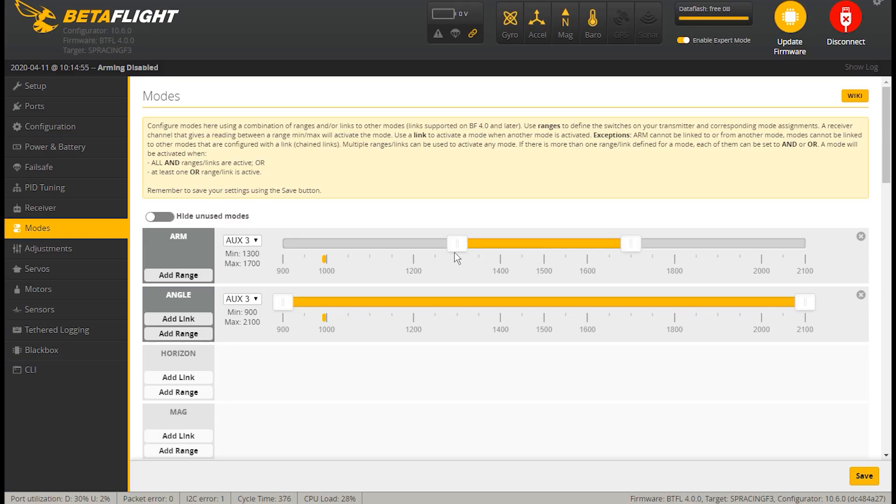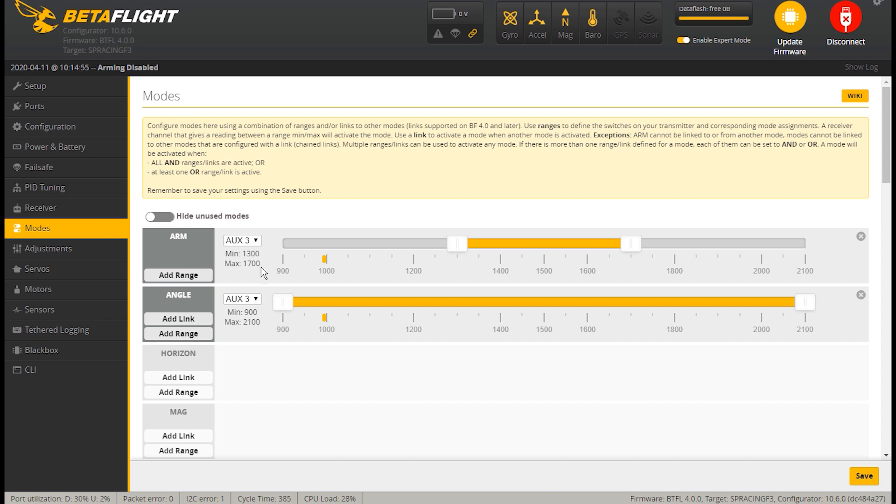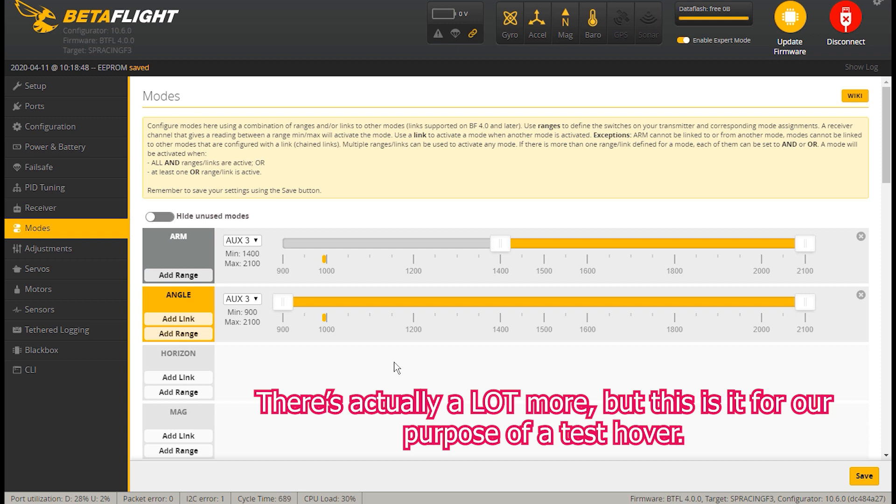The reason I'm keeping them on the same switch is for simplicity's sake, and also because we never wired the sixth channel when we did our PWM setup. Let's figure out where the switch throws to — it throws all the way to the end. So I'm going to set this so that one position is unarmed and the other is armed, which means the motors will spin up and the quad will fly. None of this means anything until you come down and hit Save. You can see the big red area — now I'm armed, now I'm unarmed.